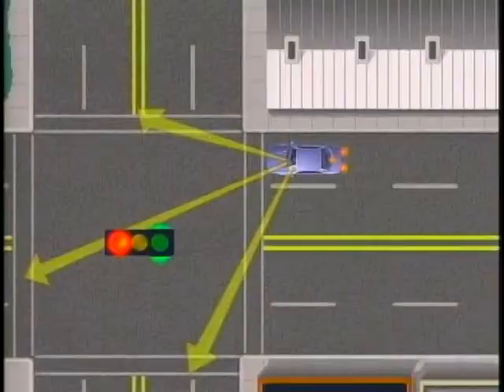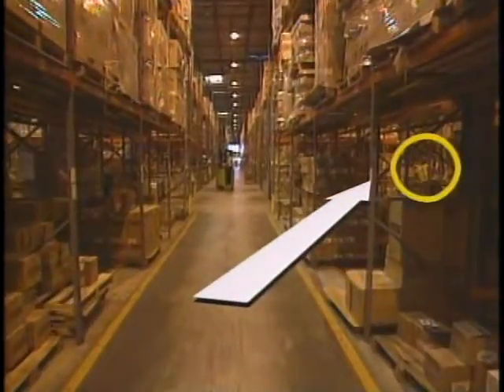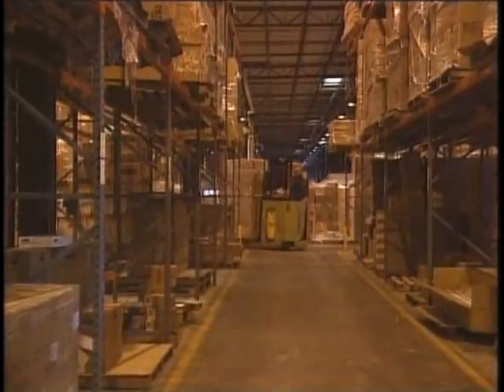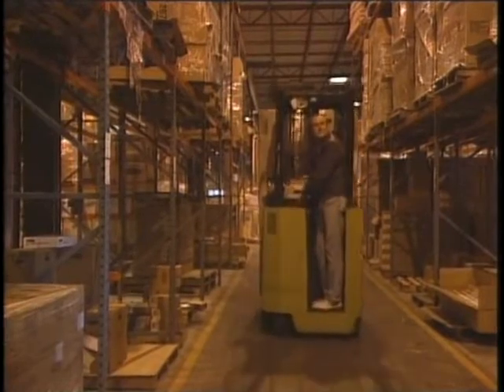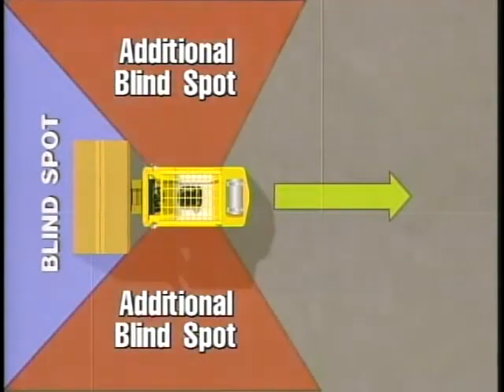While driving your own personal vehicle, you know how important it is to scan the road ahead. This is just as essential when operating a lift truck. However, it can be more difficult because the load you are carrying may block your view. This is why driving in reverse is required when your view is obstructed by the load. When operating in reverse, turn partially around so you are looking in your direction of travel. When you do this, keep your entire body inside the lift truck — hands and feet can get crushed. Even when operating in reverse, you will still have blind spots that even your peripheral vision won't pick up.